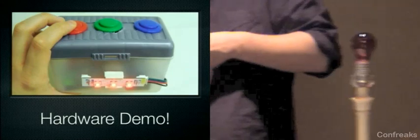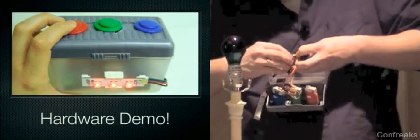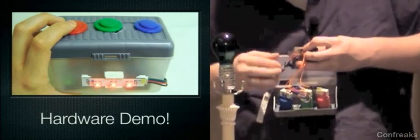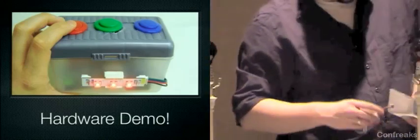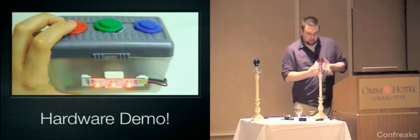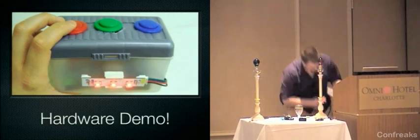Cut the blue wire. It's funny you should say the blue wire, because actually the LEDs that I'm using here, I bought from SparkFun. And the cable that it shipped with is actually wrong. The blue and green wires on the cable are reversed, which is annoying. Okay, almost done. I keep saying that. This time it's true.